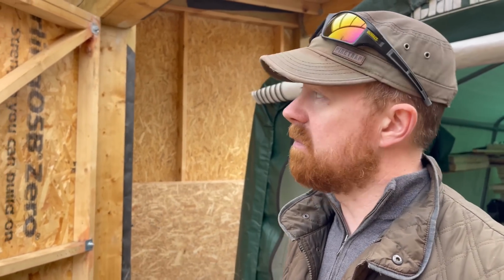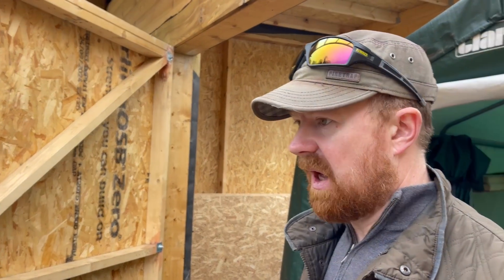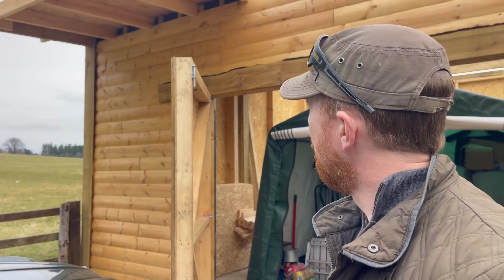What happened was the top of the pile had 11mm boards on it when I picked them up at the builder's yard. So we put 2 on and just carried on, thinking the whole pile was 11mm, as it should have been, and it wasn't. The rest were 9mm, so we've now got to take those 4 boards back off again. Happily they've written those 4 boards off, and they've given us another 21 11mm boards, which is good, on 19, because we had the first 2.